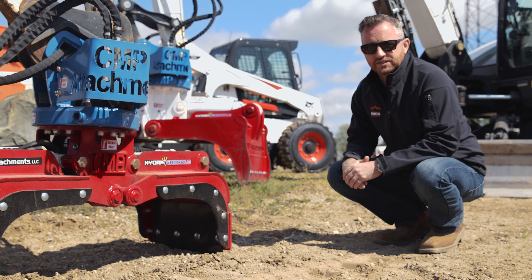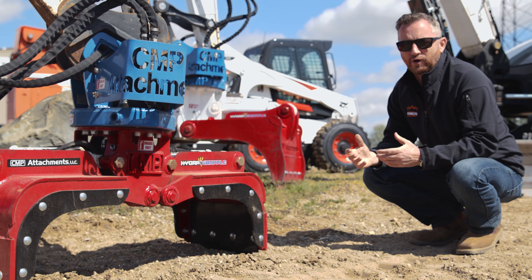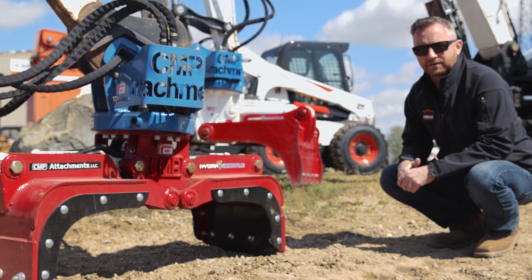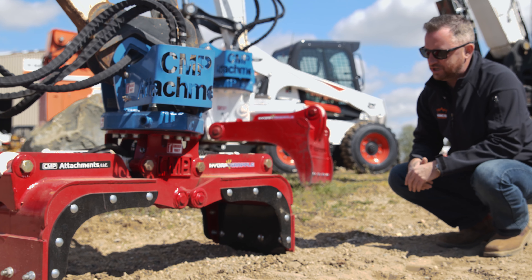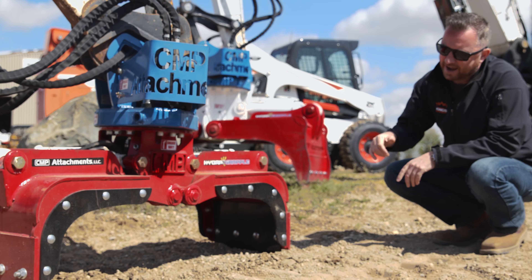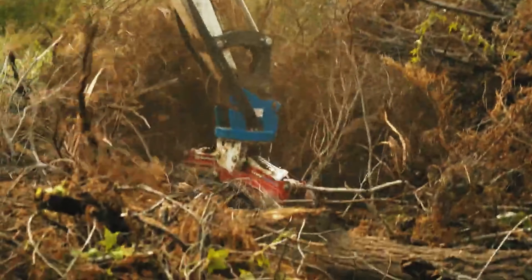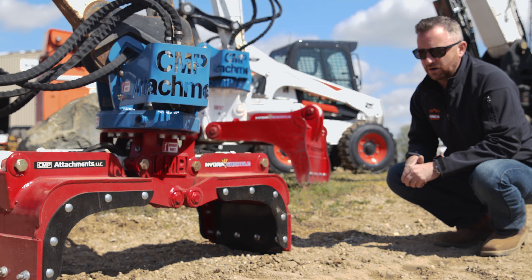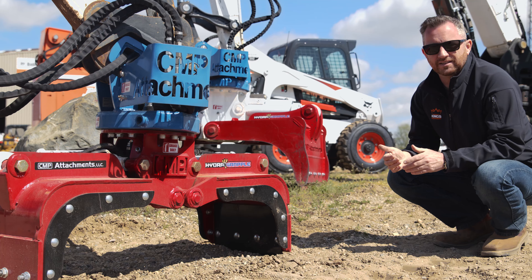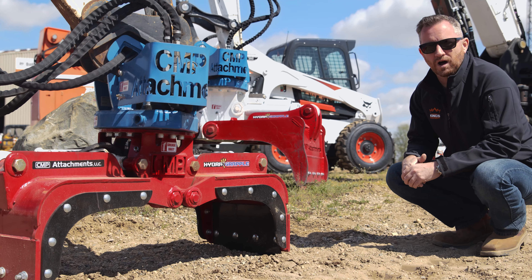Keep in mind when you're talking to one of our sales specialists that depending on the Hydra Grapple you're interested in, we've got a couple of different ways we can spec them out by model. For instance, this HG-82 model that's on our E63 has serrated cutting edges, but you'll notice on the back they're bolted on. Those can be removed if you want to go non-serrated, or they can be replaced with a rubber cutting edge in case you've got something that's just a little bit too delicate where you don't want metal on rock.